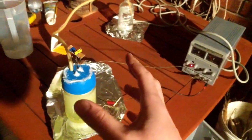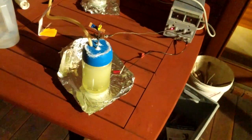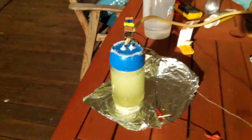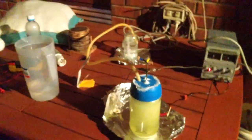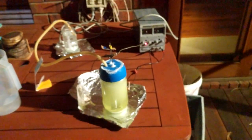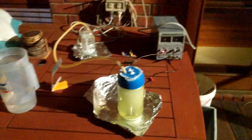We've got some undissolved chloride at the bottom and I'm going to keep topping that up. Because chlorate is more soluble than chloride, we'll have to keep adding more chloride until there's so much chlorate in solution that it starts crystallizing out — but that won't happen on the first run. I'll keep doing pH adjustments probably once a day. There are still bits of metal in there but the same number as before, so it hasn't degraded further. If you have any thoughts about this cell, leave a comment. Thanks for watching — hopefully we'll see some results a little bit later on.